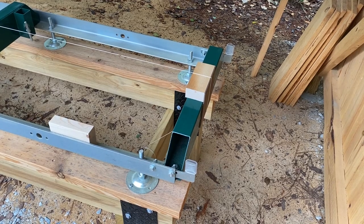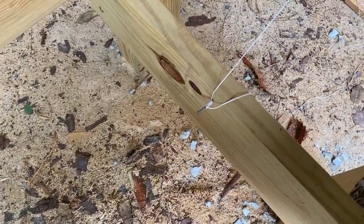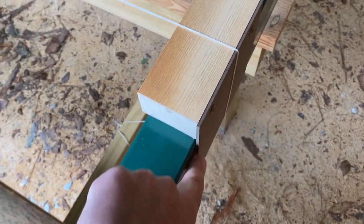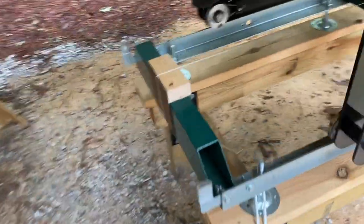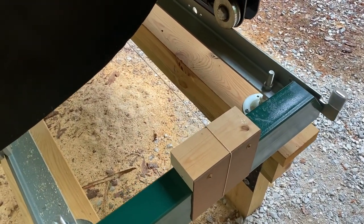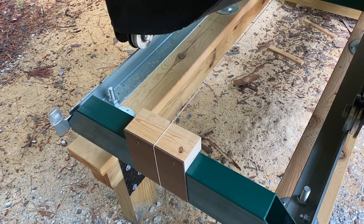Here we are back with method two. I'm going to do this with one string — you could also do it with two strings. When I set up my base, I put a nail down at the end, ran a string up over the end bunk, and made these little blocks with a piece of wood to keep it from tipping. That's a two-by-four that I lightly planed to make sure it was really nice and flat. Then I ran that string across to the other end bunk where there's an identical block. Pull the string as tight as you can — almost to the point where it feels like it's going to break — to establish a straight line between the two end bunks.